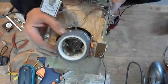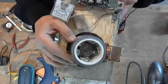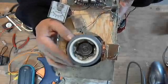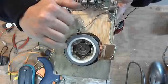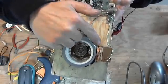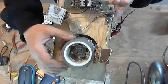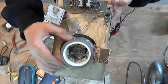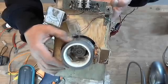I probably only have just over one millimeter gap between the pancake coil and this drum. The drum itself is three-sixteenths of an inch thick clear PVC. So that's as close as these magnets can come to the center of the coil — roughly a quarter of an inch of spacing still between the surface of these magnets and the center of the coil.